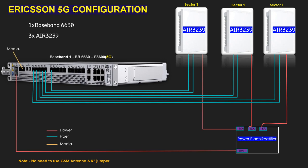We also need to give a connection from the transmission port, as you can see here. If you want to log in to the baseband from a laptop, you can use the LMT port. The LMT port has two ports: LMT-A and LMT-B. LMT stands for Local Management Terminal. There is also a sync port where you can connect a GPS unit. If you need an external alarm for the site, you can connect an RJ45 cable to the external alarm port and connect it to the rectifier.